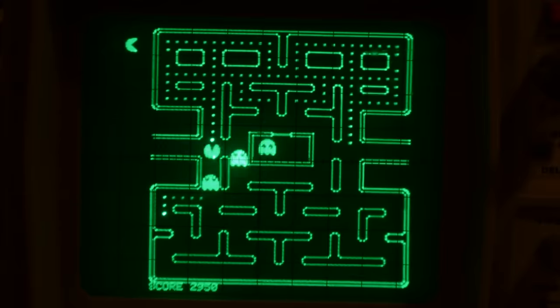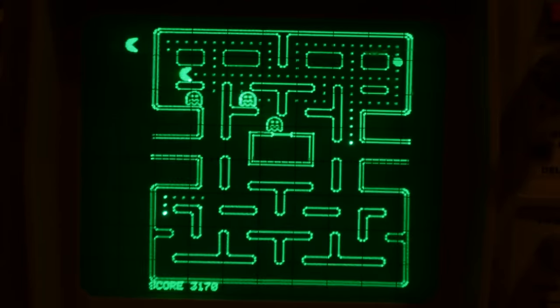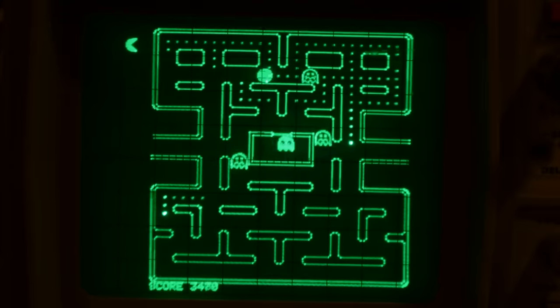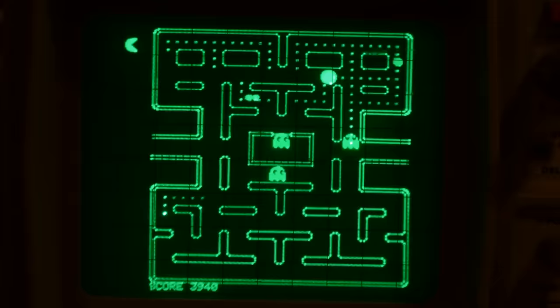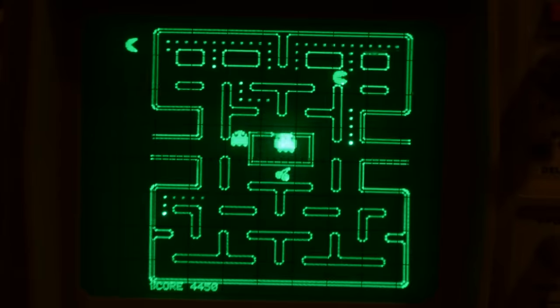Writing this game was an excellent exercise in using the memory displacement instructions. These aren't unique to Atmega chips, lots of processors have something like this. It's basically about setting a pointer to memory, and then asking to read and write data to a fixed offset away from that pointer. And the reason you'd want this is so that you can implement tabular data.